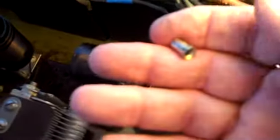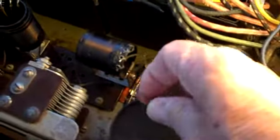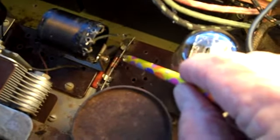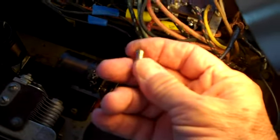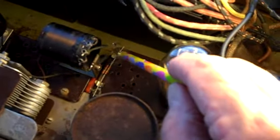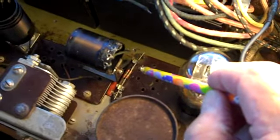What I decided to do is use the ends from the glass tube of the original. I'm going to cut the ends down, solder these two connection points I've wrapped around the wire, cut them down to length, and then solder these connectors on the end - one on each end, which was the original connector - and then pop them back into the holders. Well, that's the theory. Let's see if I can get it done.